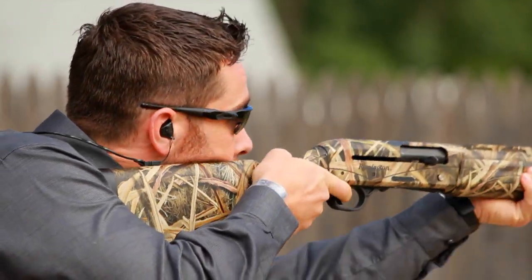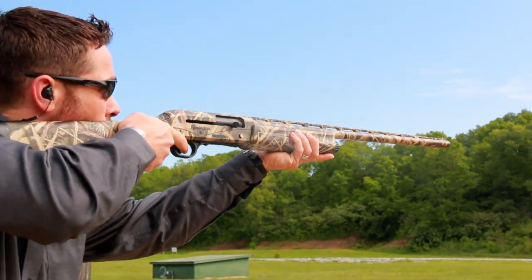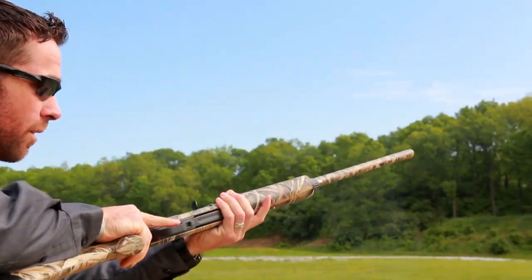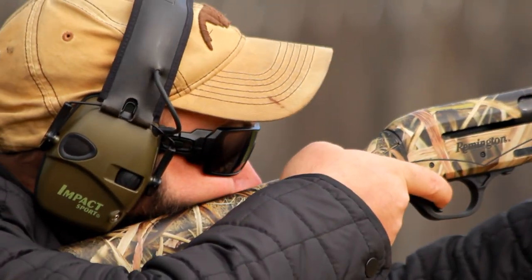On the range today, I got to experience the three-position carrier. Can you explain how that works? On a lot of competitors' guns, there is a shell cutoff, which allows you to stop shells from getting loaded from the magazine tube into the receiver — this helps when you have to cross a fence or get on a four-wheeler. We actually wanted to do one step better, so we decided to extend the carrier, not fork it so it wouldn't pinch you. It doesn't require any buttons to be pressed to load the gun. You can also cut off the mag tube and lock the carrier to the top, making it very easy to load if you have gloved hands, reduced dexterity, or are a youth shooter who needs a little help getting the shell into the tube.